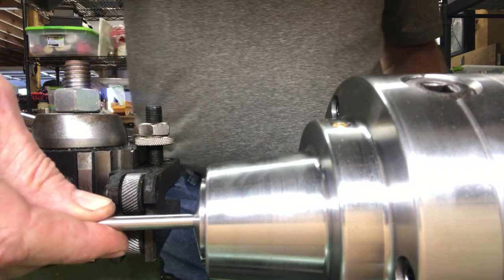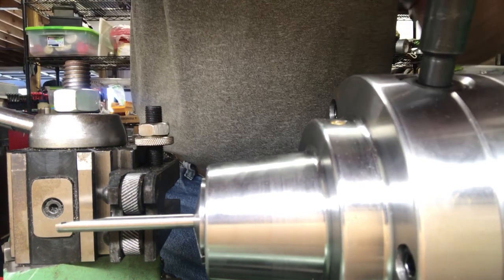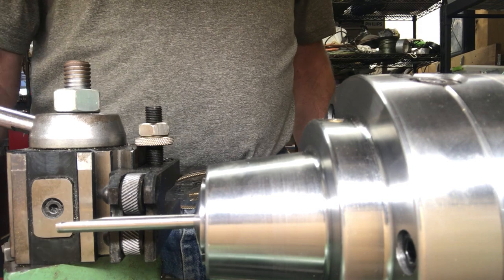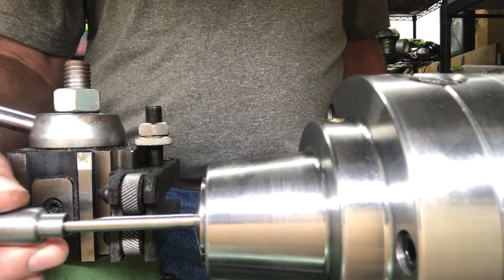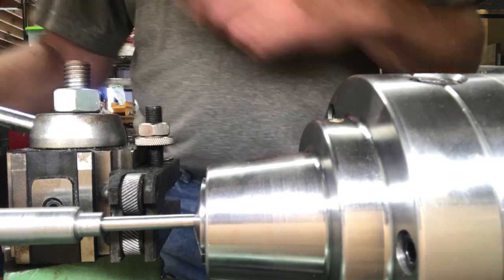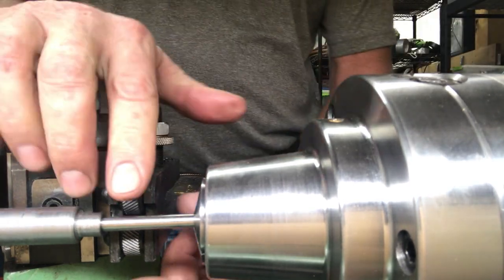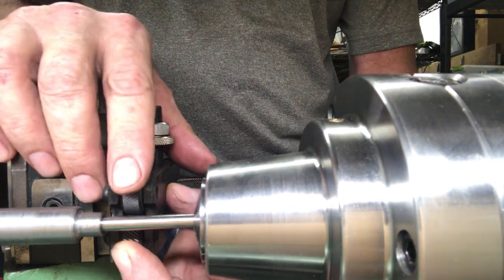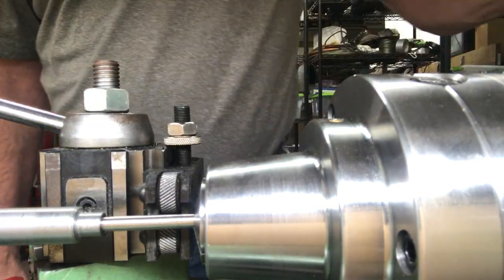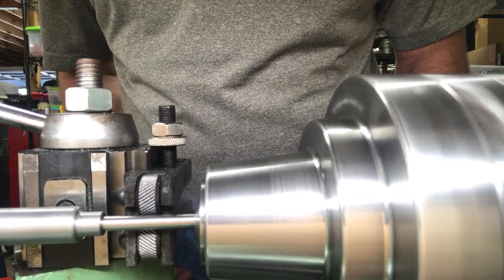What we'll do is put the tool — the plain tool — in the chuck and tighten it down, and then I have a little sleeve that I made out of tool steel also, and that'll go on the other end to prevent the tool from being pushed away by the knurler. This is the knurler and it just presses against the tool as the lathe is running and leaves a design — kind of a diamond shape.